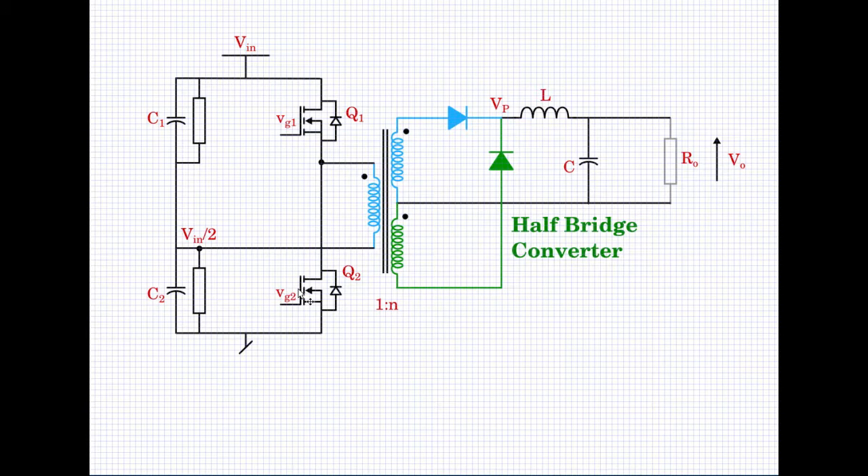You have two power semiconductor switches Q1 and Q2, and two capacitances C1 and C2. These two capacitances can be outputs of your rectifier filter circuits. The rectifier filter circuit has a C filter at the output, and sometimes the C filters are split equally — half and half — with a bleeder resistor to stabilize the voltage. You can have VIN/2 across C1 and another VIN/2 across C2. Two devices are added as a bridge and the transformer primary is one single coil.